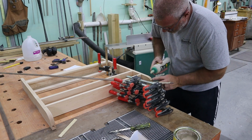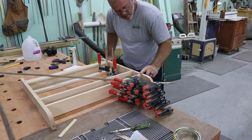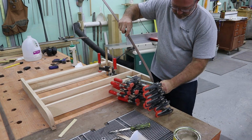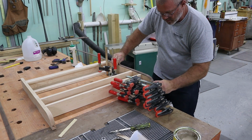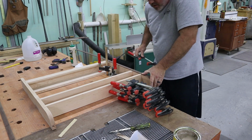Whatever wood glue you are going to be using, go ahead and put that on just like you normally would and spread it out. Next, you will want to put your veneer on and make the bend just to have it in the right place. Then get a couple of clamps on the veneer and space them out some to prevent the piece from sliding around.